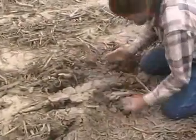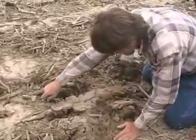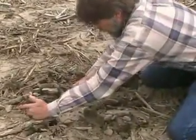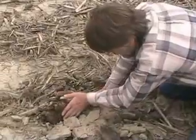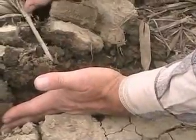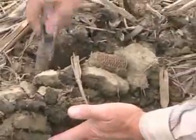Here is the entry of the tine — the machine was headed in this direction. This is the entry right here, and this is the exit over here. You have the very characteristic long engagement of the tine, which is a function of the shaft speed and therefore the resulting length of time that the tine is actually inserted in the soil. Here again is another piece of soil that has been lifted. You can see the incredible amount of fracture force that's been exerted, the force between these seven and a half inch spacings going all the way over to the other tine mark.